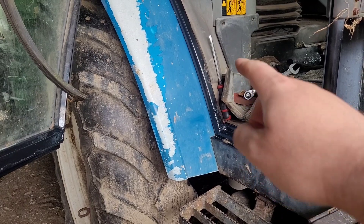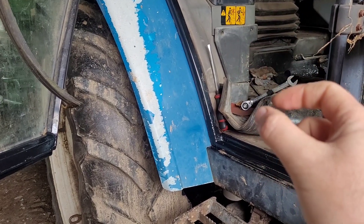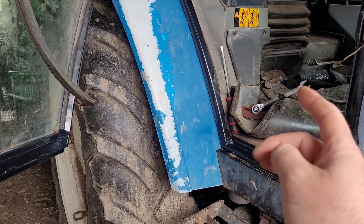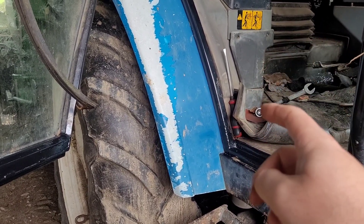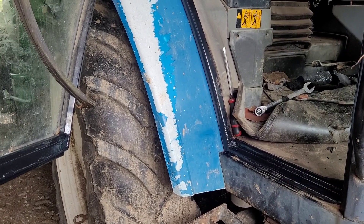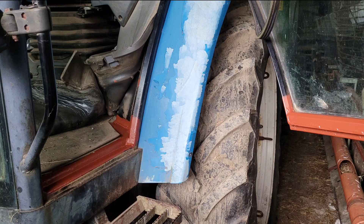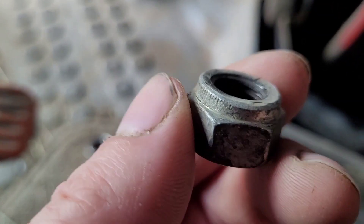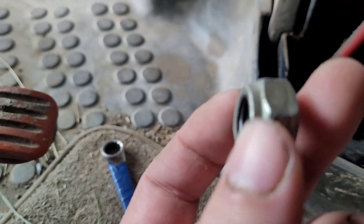While the mat is peeled back, I'll peel that little rubber bit back — there's a bolt there for the hand throttle, for the tension on it. There's a spring on the pump and you need that certain tension to hold it on. But it's gone slack and the pump is pushing it back, so you have to jam it to have it hold 540 on. I've got a new nut now. The old nut is just worn out the locking bit — it's supposed to be a pinch there but it's worn the thread out.